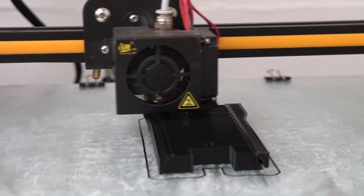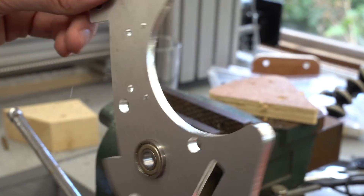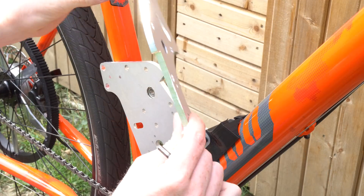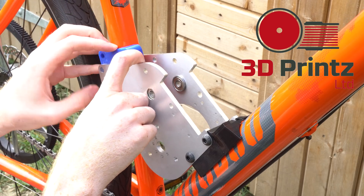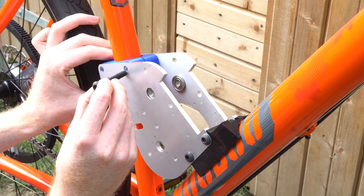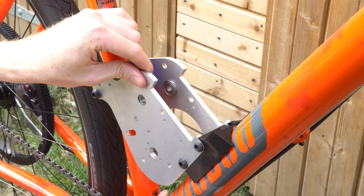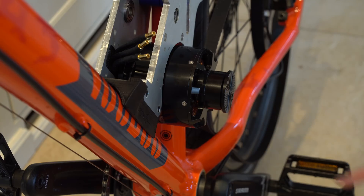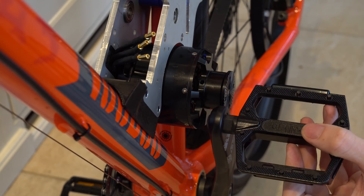It was then a case of starting the 3D printer to make the brackets whilst I tapped threaded all the holes and inserted the bearings. I first mounted a 3D printed bottle holder bracket and then proceeded to mount the plates either side. This bottle mount bracket was printed from strong PETG plastic from my filament sponsor 3D Prints UK, but the rear tube clamp was printed from PLA plastic — I wanted to prototype it before using PETG and wasn't 100% sure if the tube angle in my design was correct. I then temporarily mounted the motor to check how it fit, as I need to modify the motor length — specifically the large section at the rear which is designed to mount aircraft propellers.